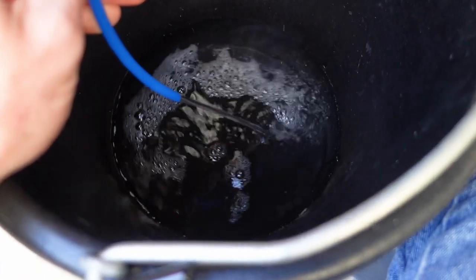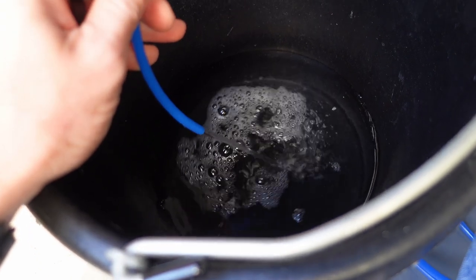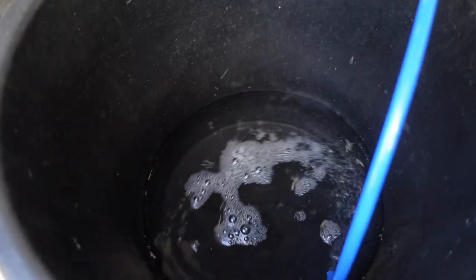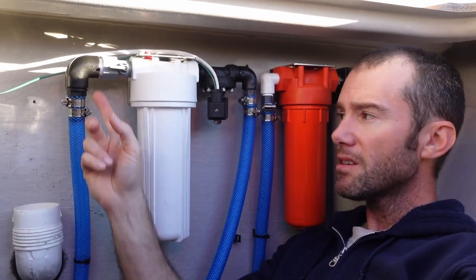What's the TDS reading now? All right, something's not right. Wish I could report this first fire up has gone flawlessly, but got a little troubleshooting to do. Looks like I've got really small leaks coming out of both of these elbows for the filters. So I'm gonna take those apart and try that again, I guess. And then also the 12 volt solenoid diverter valve isn't diverting properly. It kept everything going to the high TDS reading side of the line.